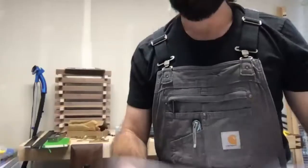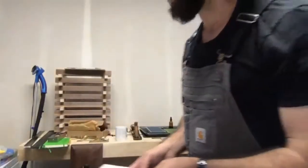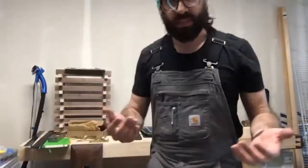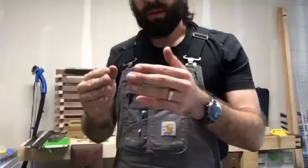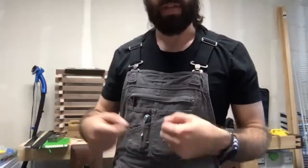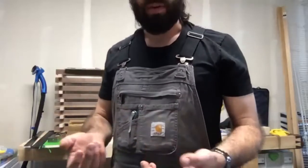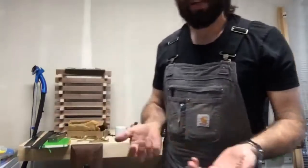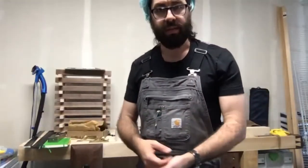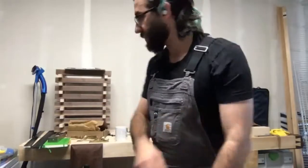And so it makes it so that you can go from something that's starting to dull to something that is truly sharp much faster because you're doing a lot less work. And then as you do it, that secondary bevel is going to get bigger and bigger and going to require you to remove incrementally more material each time you do it. And at some point, you'll get irritated with the fact that it's taking you longer, and then you grind the primary bevel all over again. You use a power tool to grind that back out.